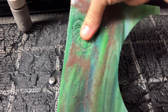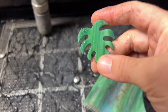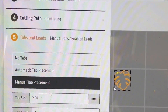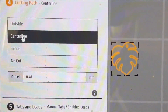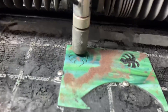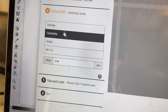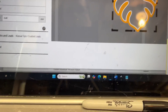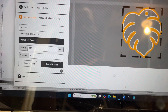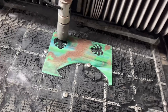It's super teeny and cute, but there's some changes I want to make. At this scale, I don't want to be drilling any holes in this piece myself, so I'll add a little circle design into the mix so the Wazer can do that for me. I'll also try to use the center line cut option to reduce the gaps between the leaves. And now we try again. I like the gaps better, but my circle hole is ugly and probably not super stable. So finally, we move on to trying the outside cut type. I originally didn't choose this one because it looked like the lines would overlap each other, but since there will always be a little bit of space for the cut itself, this might be the perfect size gap I'm looking for. So on to round three.